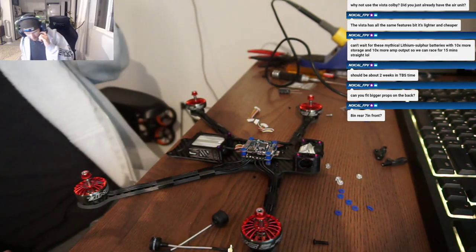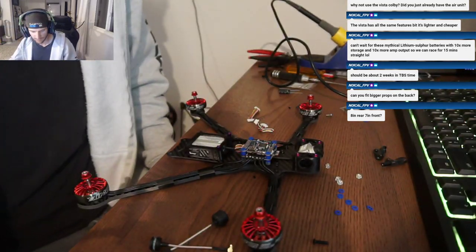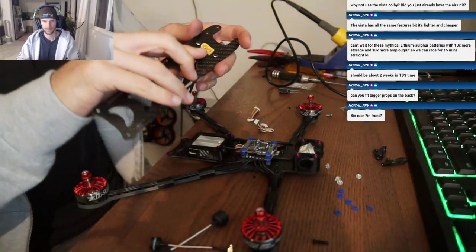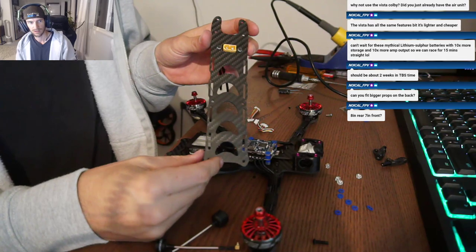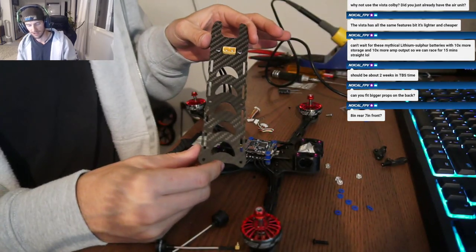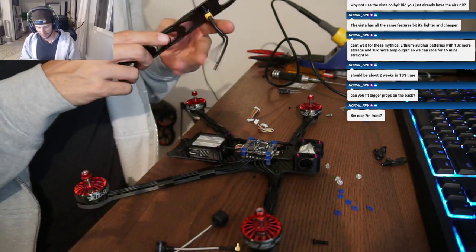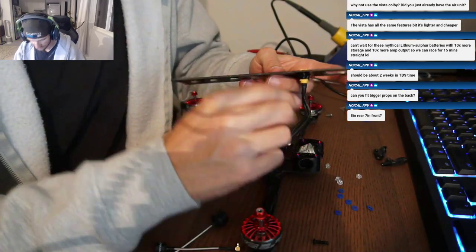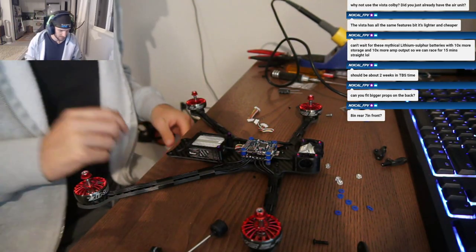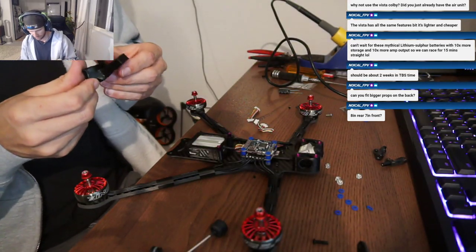Which strap did we add on the top plate? Which was the slot that we added, the front one? Ooh, everything moved on the top plate. Everything moved, yeah. Now I'm using the two middle ones and it's perfect. Y'all have never seen four battery straps on a frame before, I know it. I know, it's outrageous. But if you were running 4S and one of the 5200s, the 135mm battery, you could use the front and the back one, or the front and third one pretty well.